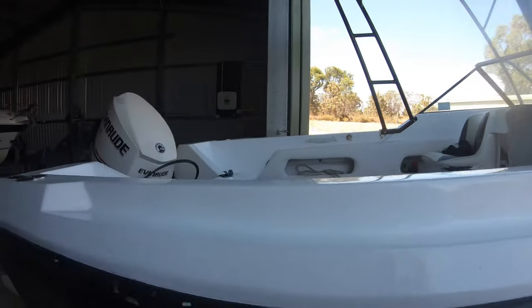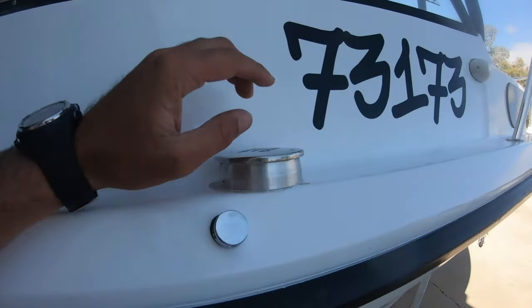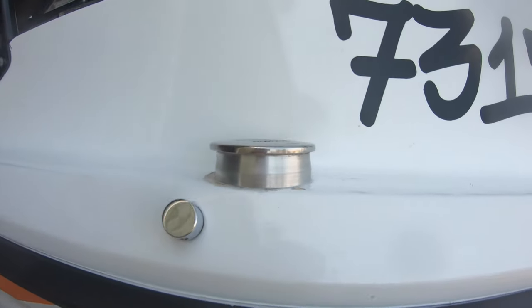Last night we took Angry Mac 2 out to make sure the engine still runs 100% after cleaning out the fuel system, and yeah, the engine's all good. We also got a couple of crabs, which was a bit of a bonus. Now we're going to hook up the internal tank again and get rid of the external tank. We know the engine's good. I've finished the fuel cap — put a 10-15mm raiser on there, thanks to the old man for doing that on the lathe — and a brand new breather. The internal tank is completely siphoned out, but there's still a little bit of stuff on the bottom, so I'm going to put 20 litres of fresh fuel in and pump it out with a small inline 12-volt pump to circulate the fuel and get as much of that gunk out as possible.